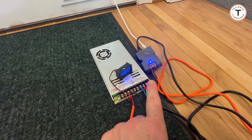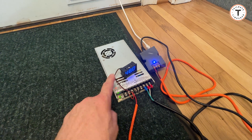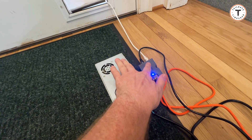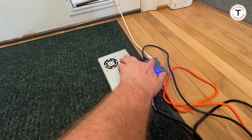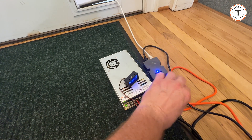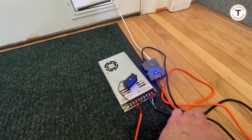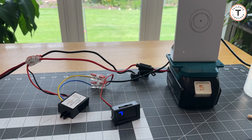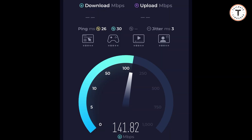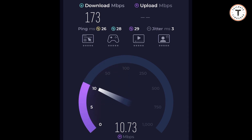This little dongle splits out the ethernet and the power all running through one cable. We now have the 48-volt power supply injecting power into the ethernet injector. The white cord goes out to the truck to the splitter onto the Starlink mini, and the black Cat 6 cable goes to the router mini on the tabletop. Let's run a speed test with the ethernet injector — we got about 176 to 179.